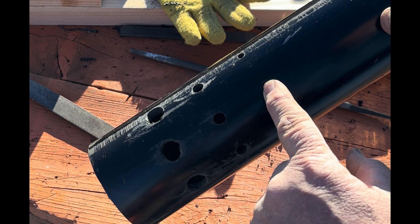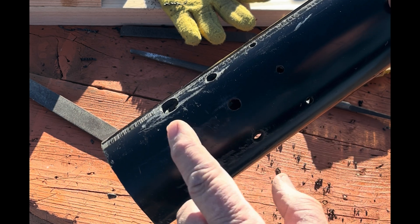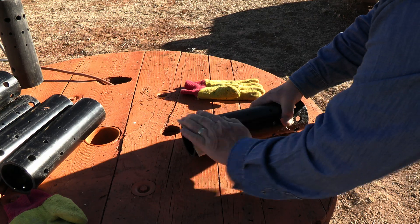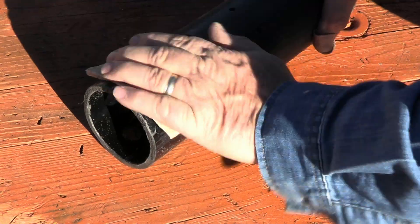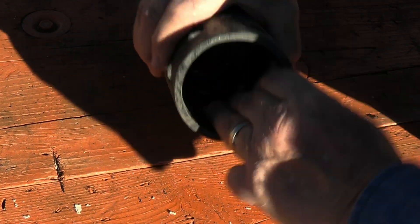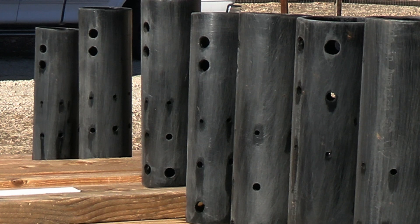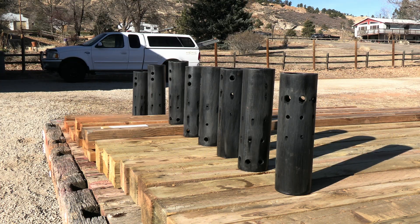I started in the middle of this with a smaller hole and put three sets of holes — small, medium, and large. Quick tip: the static electricity on these things won't let you just wipe them off with a cloth — they'll still be dirty with pieces of plastic stuck on them. Take them in and rinse them off real quick; the water will stop that static and every bit of this stuff will come right off.